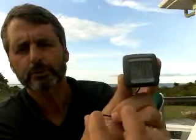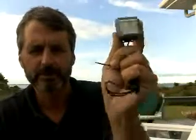As you can see, it can produce a reading. If you can produce a reading by tapping the wires together, the display is fine. And if it's still not producing a reading with the wind sensor attached, chances are it's the wind speed sensor that needs to be repaired.